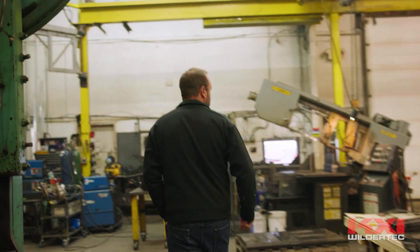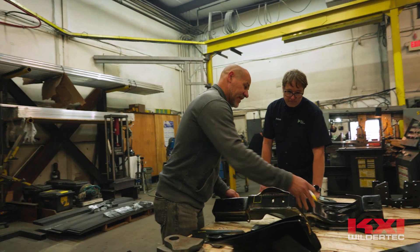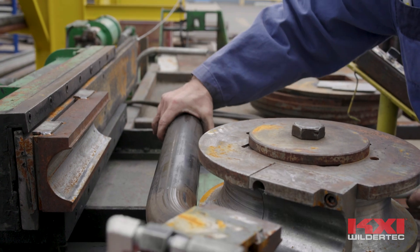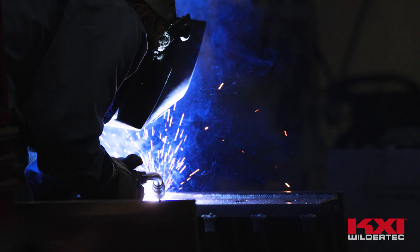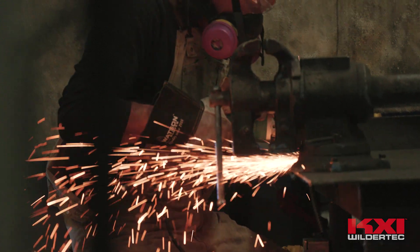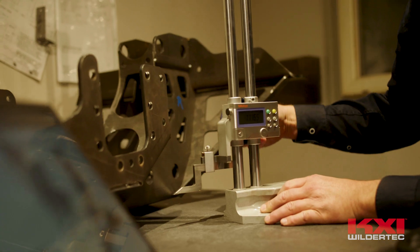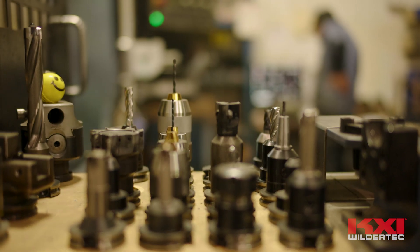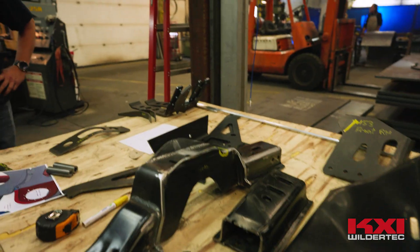A lot of the custom componentry was built in town. We're fortunate enough to have quite a few skilled fabrication shops, so we ended up working with Pacific Industrial Solutions. Friso and his team are quite adept at doing the weird and wonderful. They're right in the middle of finalizing a lot of the welding and fabricating for us. We're here checking out the progress, making sure all the dimensions and tolerances look correct, and hoping to get everything off to powder coat and back in our shop next week for installation. Two degrees off could mean a bolt hole being off by three-quarters of an inch — it's very, very specific. Every single tolerance adds up and they all have to align to make sure this bolts to the truck.